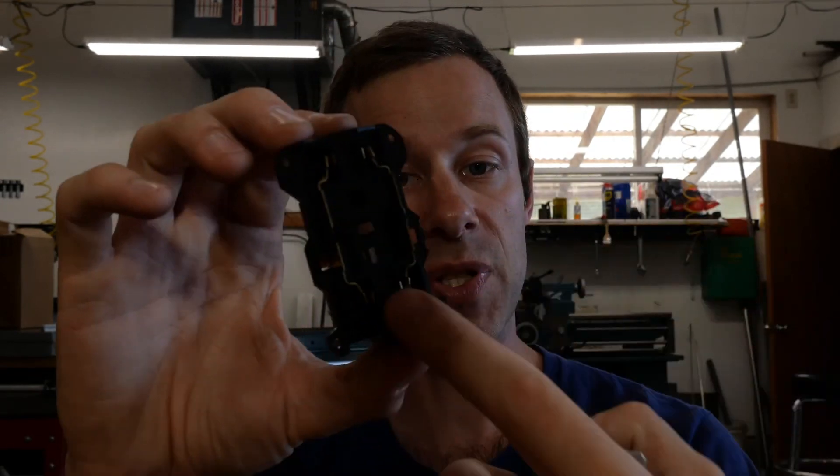These are the actual springs where we plug our stuff into in the actual GFCI outlet. So that protection not only works to disable the outlet itself, but all the outlets downstream. That means it's really important to know which outlet is the first one so that we can put the GFCI on that one. If you have no idea, sometimes it's safer to just put a GFCI at each outlet. They are more expensive, but your guaranteed protection factor is a whole lot higher.